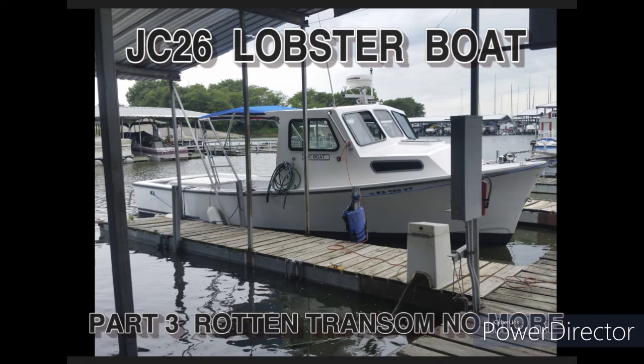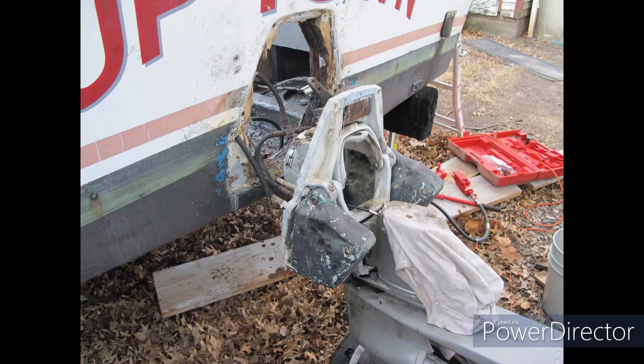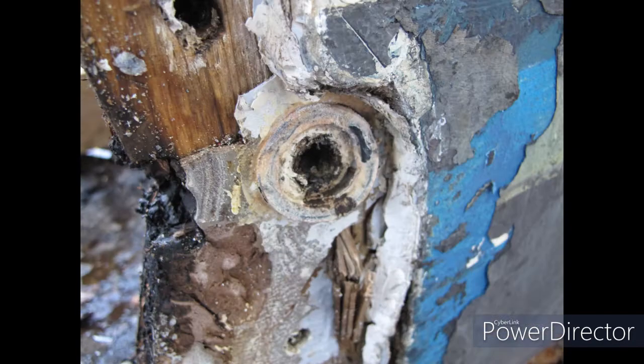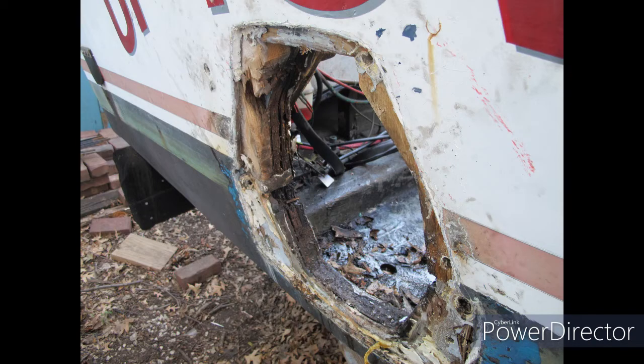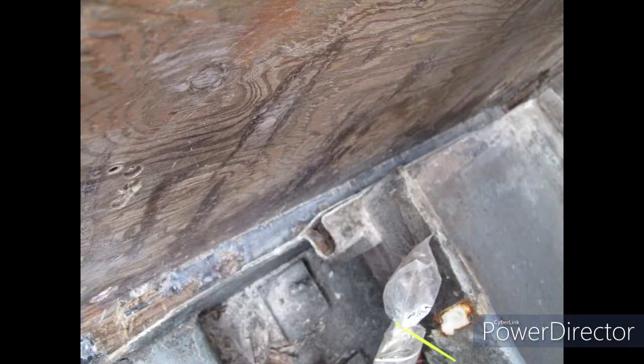By now, I've gotten the boat home, cut out all the rot, and removed all of the delaminated wood and old plywood and everything. And now it's time to remove the transom plate. I had to pry that sucker off because it was attached with 5200. But if you look at it, it's obvious that the rot is from the inside out and not a result from the seawater getting into the boat, which just reinforces the fact that the water came in through the leaking transom cap.